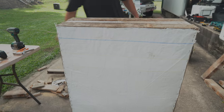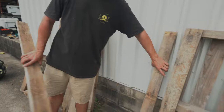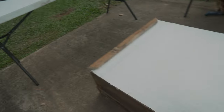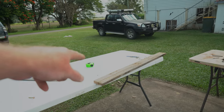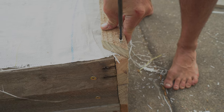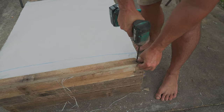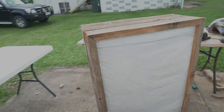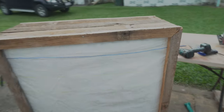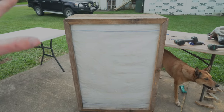Now we're going to put a little bit of skirting board around the outside — cut one of these in half at 1050 and 800 with a 45-degree mitre on it, so we've got top and bottom, then do the other 45s and screw it all together. There it is ladies and gentlemen — we just finished. A rustic free target, completely free, zero dollars.